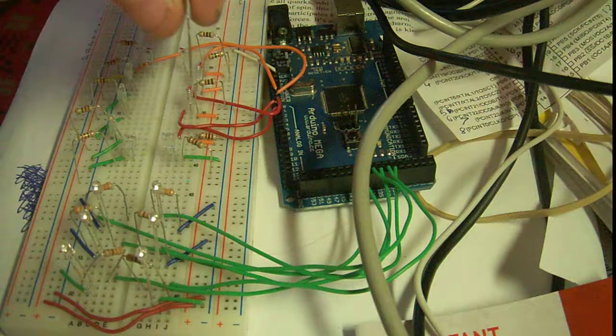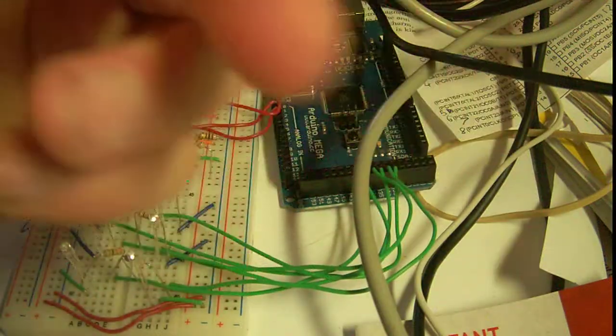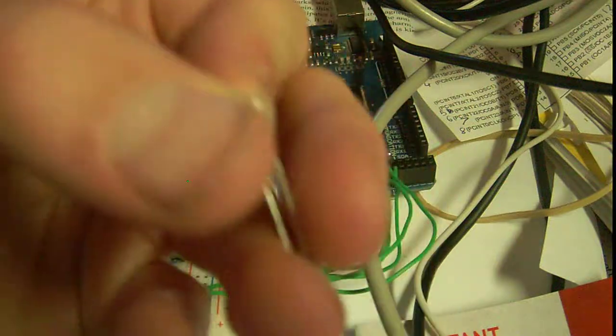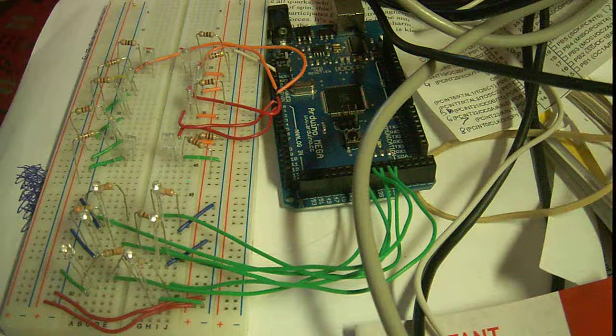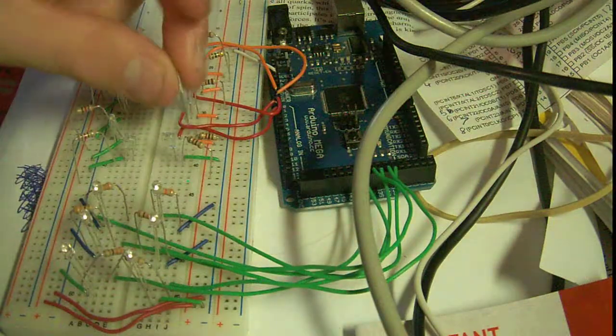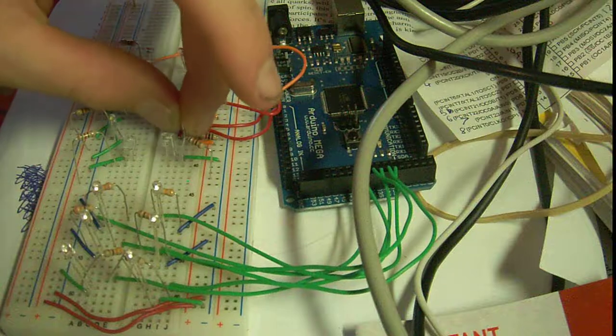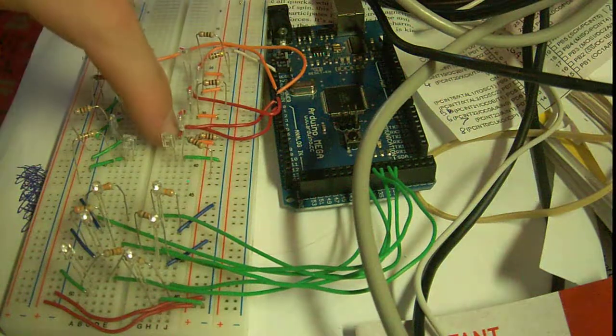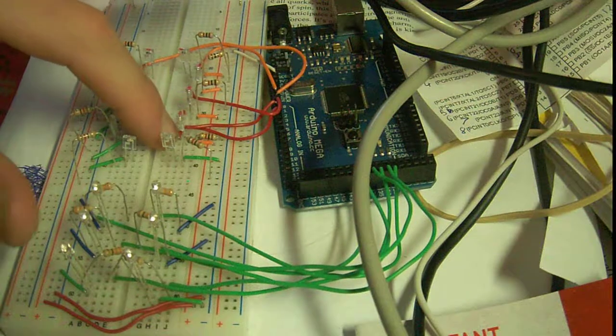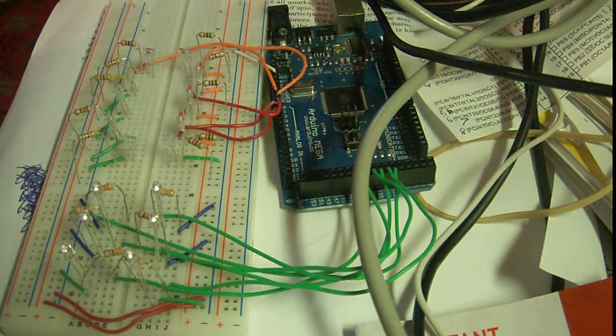In case you're wondering, for the SparkFun receivers — they have two leads. The longer one I have connected to positive, and the negative one I have connected through a 1K resistor to ground. And then at the negative lead, where it's connected from the 1K to ground — there's the 1K — I have it sensing at the beginning of the 1K, so at the negative lead, and it just goes to an analog input pin.